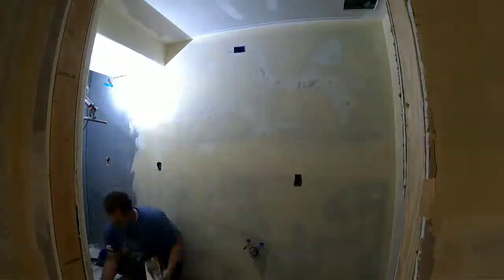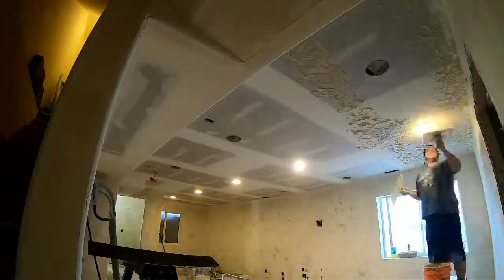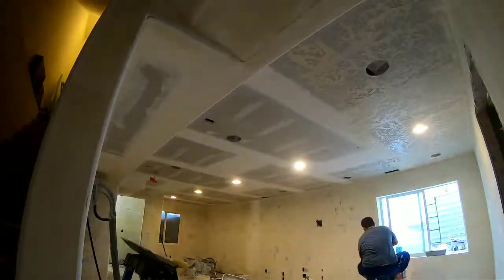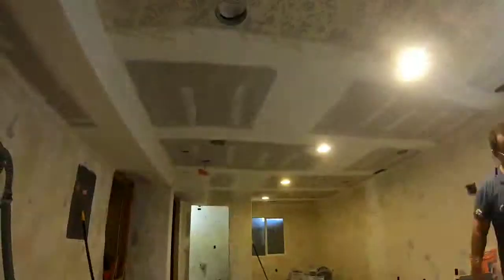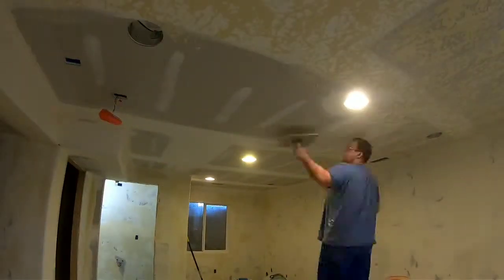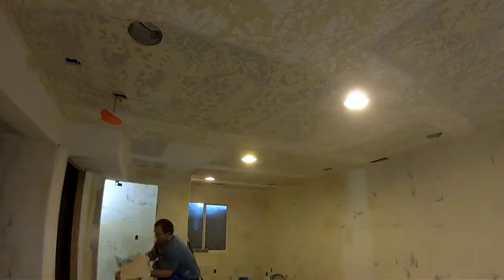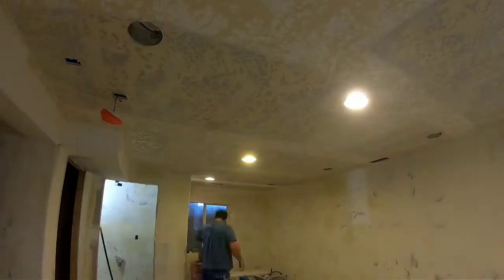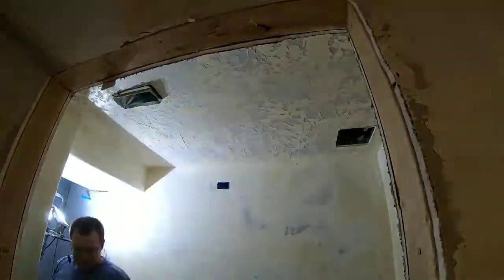For the ceiling we're using a classic knockdown. We will need to pre-sand. I've used my power sander there, so we need to sand all the edges and want this extremely flat and smooth because you'll see any imperfections through that texture. That's why I always do a fourth or fifth layer on the ceiling for a flatter, more pristine finish. For the knockdown texture you take two hawks, do a thin layer, smush them together, pull them apart, stomp it up there, then wipe it. It's really fun and satisfying.